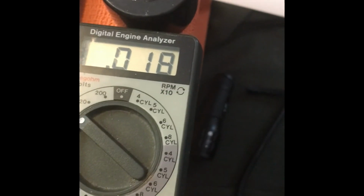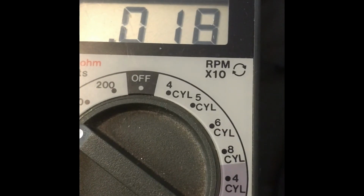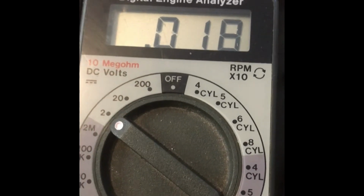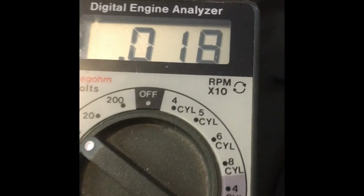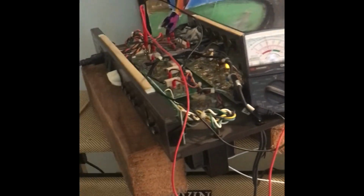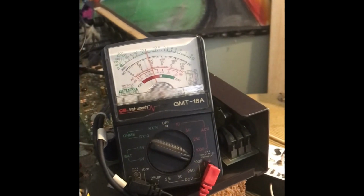I'm pretty happy. We got a steady plate voltage, 385. It's 75 milliamps across the standby switch according to the Carvin method, which yielded dead on the money for that replacement tube I just put in there. For the other ones, they could have been warmed up a little, but since it's an unmatched set, I don't want to risk it. Okay. Well, that's been the Vox Pathfinder channel, and I hope you found that somewhat informative. Thanks for tuning in. One more thing.